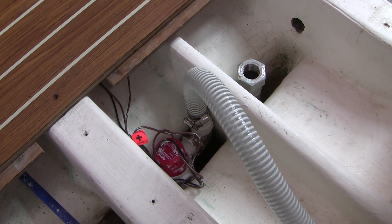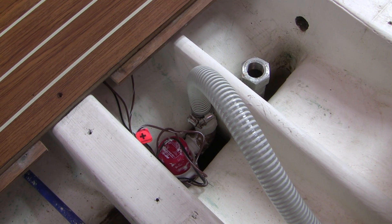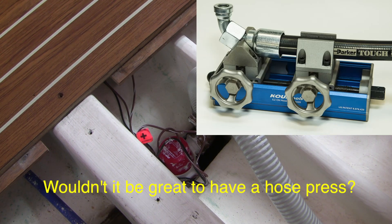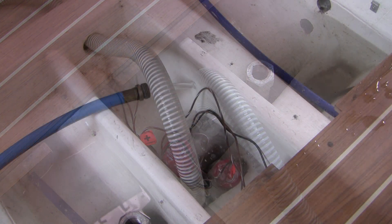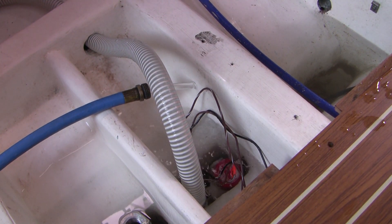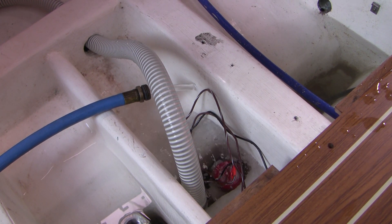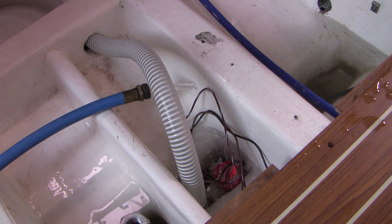With difficulty I got the hose onto the hose barbs on each side — it was really tight. Eventually I ended up using steam to warm it up a little bit; a hair dryer probably would have been better, as the heat gun can overdo it. We've got a partial success: we've got manual control. When I hit manual, it drains nicely — my flow is good and I've got no leaks on either side. Listen to the anti-siphon valve grunt as it shuts off.